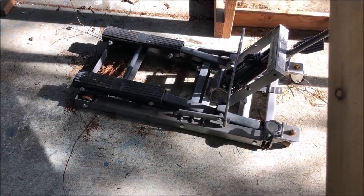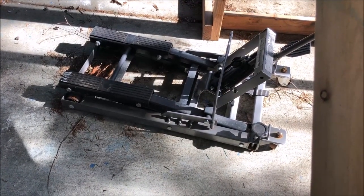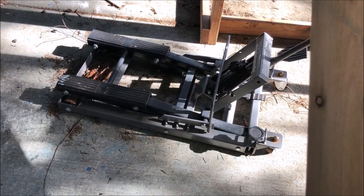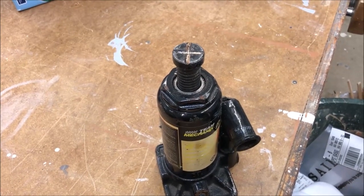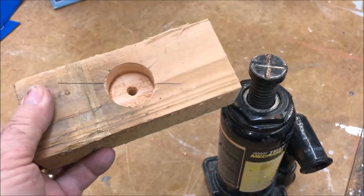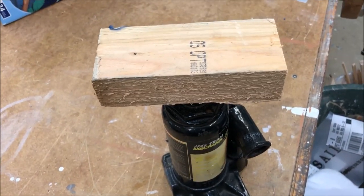We're going to need some way to relieve the pressure on the front of the keel before we change the bolts. I happen to have a motorcycle jack that I use to remove the keel, but I'm going to assume that most of you don't have one, so let's see if we can modify a bottle jack to help us out. Here's the little bottle jack I use when I put the boat up on the stands. I just took a piece of 2x3 — good quality wood that won't split — and drilled a hole so it will fit nicely on top of the jack and give me a little bit of balance.